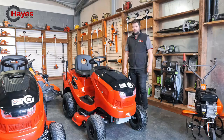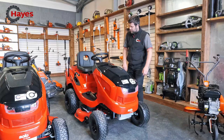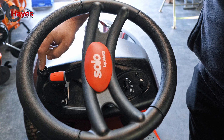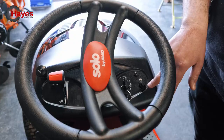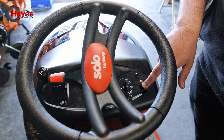The T16-93 comes with LED lights. Also, very easy controls: you've got your throttle here — full throttle for mowing — and your choke for cold starts, pull it out, push it in once it's warm. Easy ignition key here; that turns your lights on, turn it to fire up the engine, and back to off. You've also got a reverse button here which allows you to basically mow in reverse. With most ride-on mowers nowadays, this is the safety feature — push this in and it allows you to mow in reverse so your cutter blades don't cut off. When you're going back into normal mowing mode going forward, release this and it will allow you to carry on.